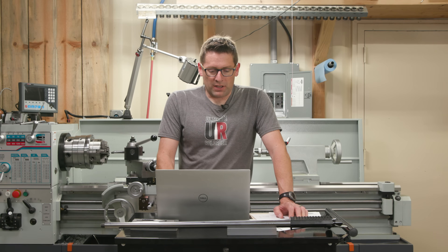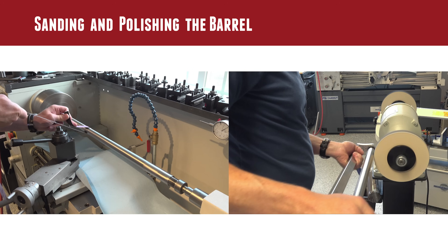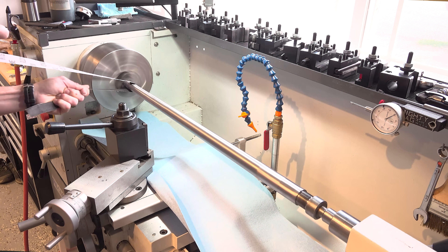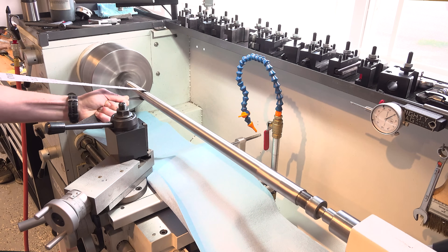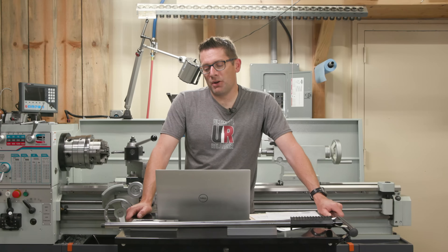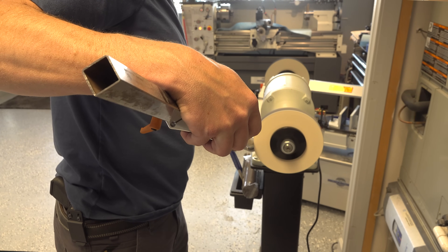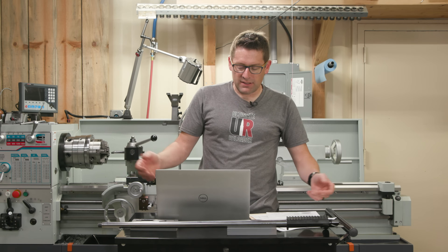That's really all of the on-lathe work. Now we're going to deep dive into the finish work for the barrel. This Krieger blank had some machining marks on it — ridges from their final pass — so I chucked it up in the PM-1440 GT with a live center on the tailstock so there's no metal-on-metal movement. I also have an aluminum thread protector for the muzzle end chucked in the spindle so I can spin the barrel at whatever RPM. I started with 80 grit paper and moved up to remove those ridges, then used various grits and wheel types on the polisher — starting with 150 grit moving up to 400, 500, and finally an ultra-fine — achieving a near-mirror polish on the barrel.